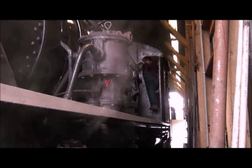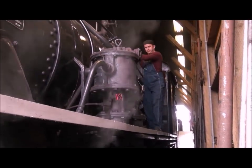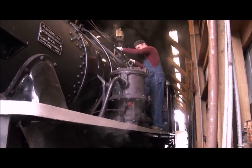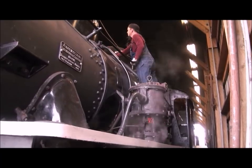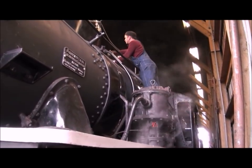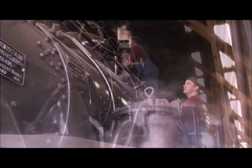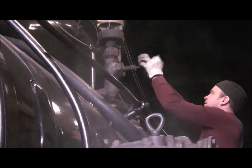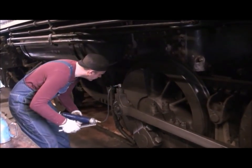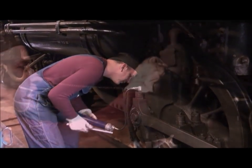If you're getting lots of black smoke, something isn't right. Now you have to be fairly physically fit and relatively nimble because as we get this locomotive going, you're going to have to climb around some. Right now Ryan is opening these non-return valves, which are part of the injector system. You've got to get up there and move stuff around. When we turn something on, you turn it all the way to the end and then a quarter turn back. You want to wear clothes that you can get dirty because part of your job is climbing around, oiling and greasing stuff.